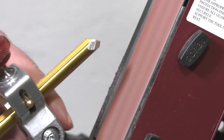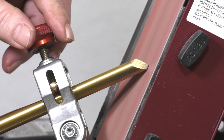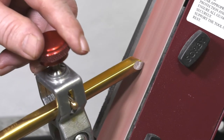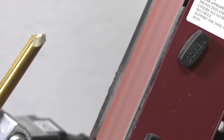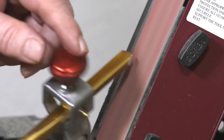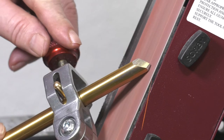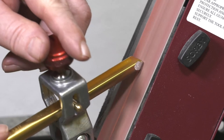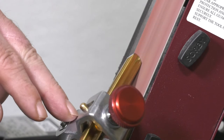Switch on the ProEdge and start on the right wing. Then take the tool away from the belt and do the left wing. Then away and finally the nose. Check the horseshoe and see where you still need to remove material and where you don't. Flat surfaces reflect light but sharp edges don't, so it makes it a very easy guide to see where you still have work to do and how much. Continue the one, two, three procedure until virtually all the flat surface is removed.